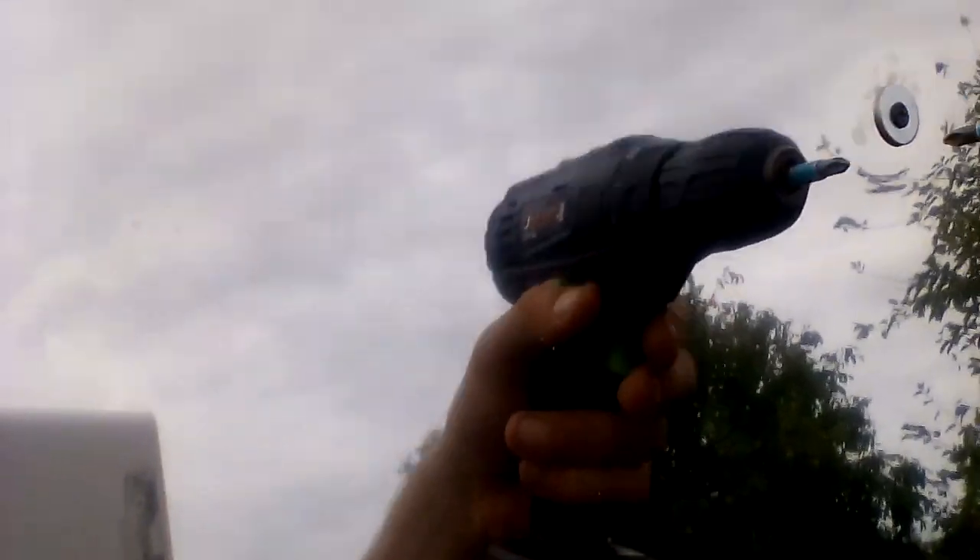This widescreen will help us better see the spot of solar radiation from my stainless steel sheets. We can notice that the height of the spot is less than 10 cm, while all my stainless sheets have a total height of 170 cm. If we need a lower spot, we must use another method of fixation of the stainless sheets than these screws.